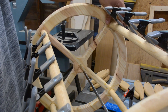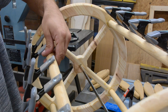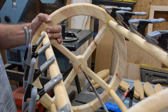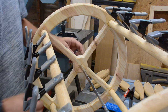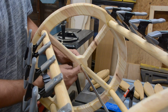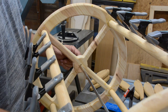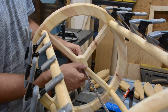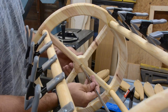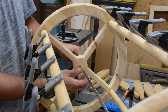Once your wheels are complete and your rod holes are all drilled out, it's just as simple as cutting your four dowels to an equal size and gluing them in place, then clamping the whole thing together. Just make sure everything stays square while you're clamping and gluing up, and then you're basically done. I drilled out a hole for the center rod to go through. This is a square rotisserie rod, so all I did was take a drill bit just a little smaller than the rod, drill the two holes on each side, and drive the rod through. It's a square rod through a round hole so it's basically a friction fit — a pretty tight fit. It took quite a bit of pounding to get it all the way through, but once it's in it's going to stay in place with no slop whatsoever.